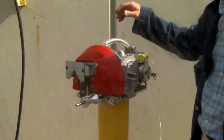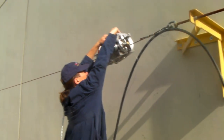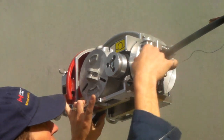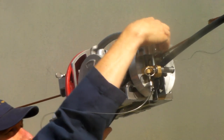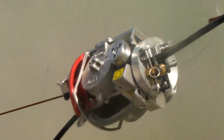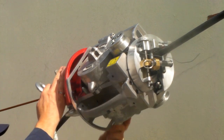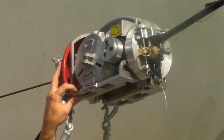When you're ready to start lashing, the Eagle lasher is the lightest on the market, weighing 24 pounds without wire. But even with the wire loaded, it's easy to get up on the strand. Set it on its rollers, close the front strand lock, put your cable in, and close the rear roller. Make your final adjustments for the rollers, close the front, and close it on the roller. The machine's going to spin now. Get your tow rope, tie off your wire, and start lashing.